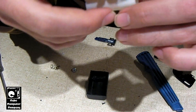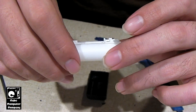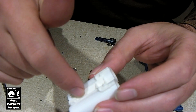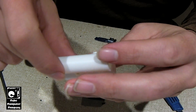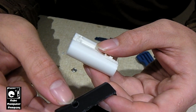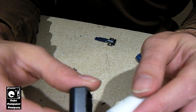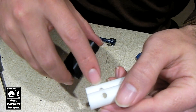Here are the 3D printed 14430 dummy cells. I got them super glued to this plastic piece that used to snap over the lithium ion cells. What I've done is on the rear of the shell I've drilled a hole — I put this whole assembly in here and just drilled through the outside case, which also went through the two dummy cells.